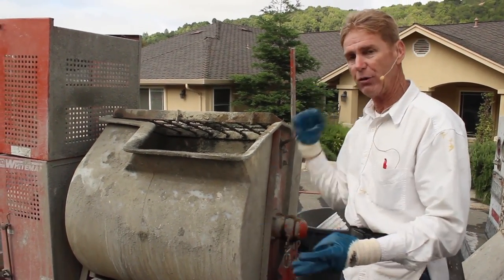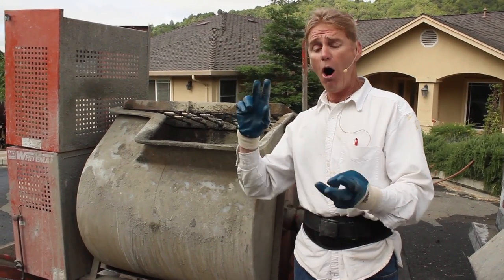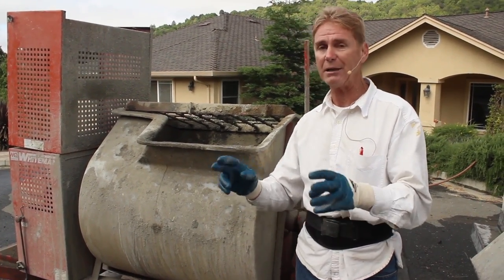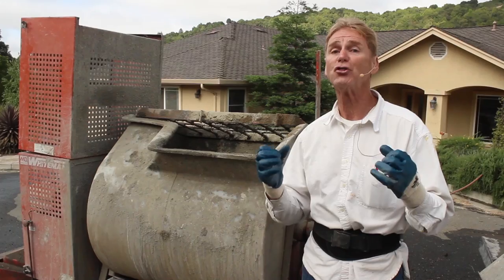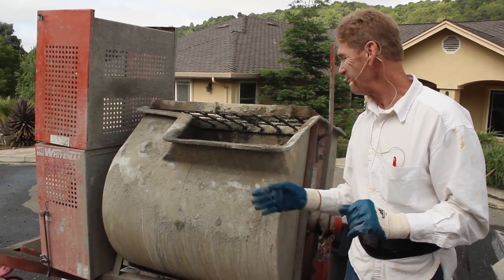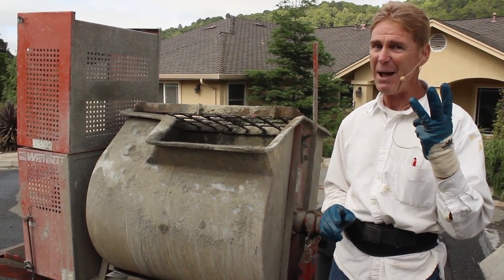You turn those blades off, because if you mix it more than 3 to 5 minutes, all the same day materials, or all of the scratch and brown same day back to back materials, you cannot over mix them. Why? You jack up the integrity of the strength. I'll leave it at that, guys. Westside said they should sell a stopwatch with this stuff, because 3 minutes is the max.